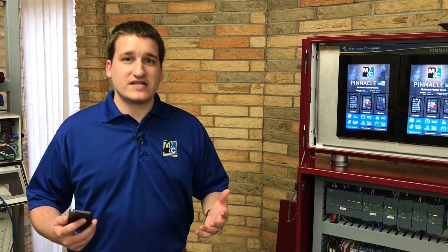In order to get access to this, it'll require an update to the PLC and HMI. This update is available on all dryers that are equipped with an S7-1200 PLC. This PLC comes standard on all Pinnacle 2020 machines, as well as Pinnacle Lite machines going back to 2015.